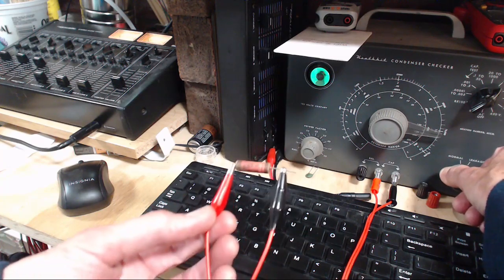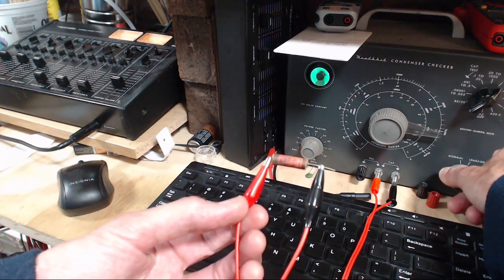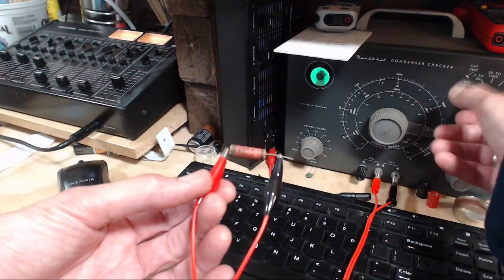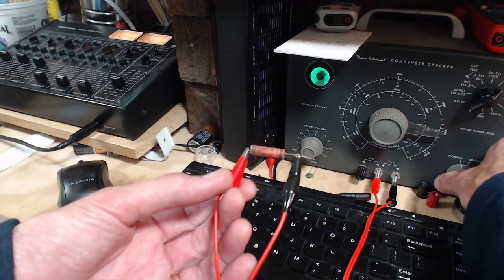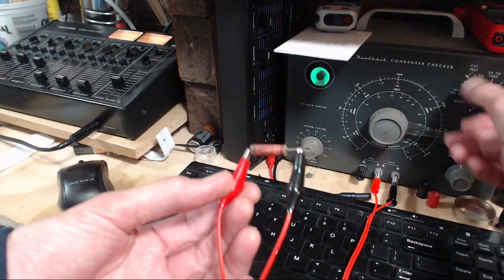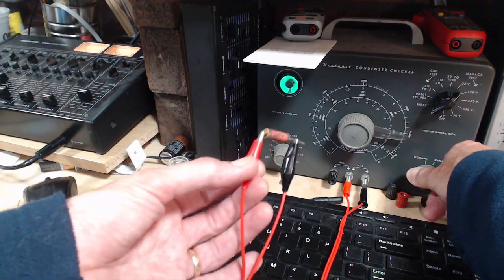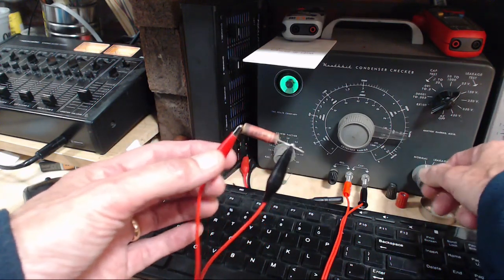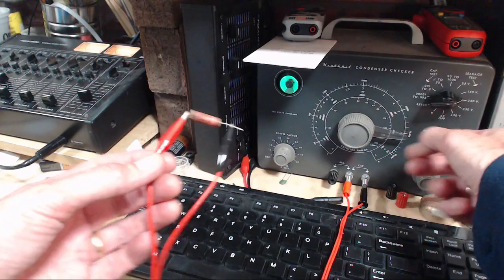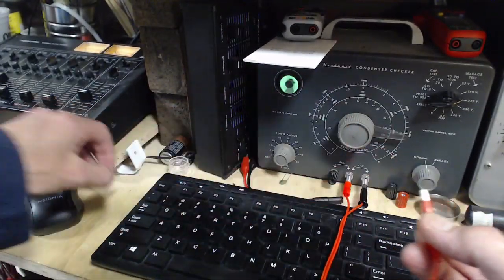50 volts. Hey, what happened? How could that happen? I probably have this shorted in there. Okay, let's keep going. It's only 50. This is supposed to be good for 1,000 volts, man. Let's see. No. So now we're putting 150, according to this. 150 volts on it. It's right around 150, and it's a leaky guy, of course. Let's put 250 just for fun. Hold your hands back. Not opening at all. Surprise, it's bad. It's leaky enough, probably the charge has gone in it already.